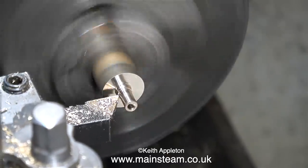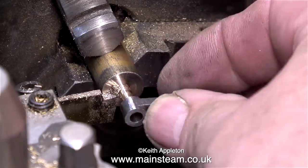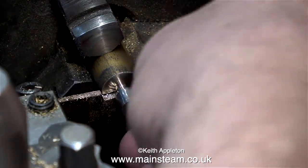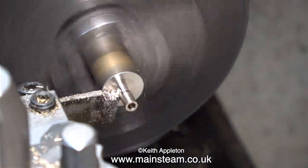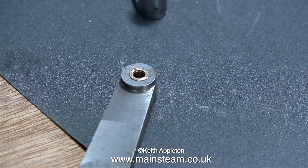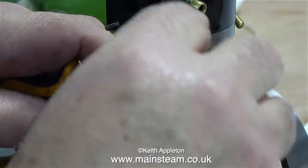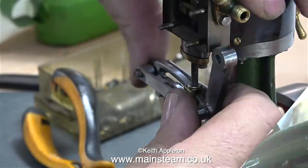To allow for parting off, I'm just taking off a bit more of the metal — it will make parting off slightly easier. What I'm doing here is trying the drop arm in position and then setting the parting tool to cut the bush to the correct length. A number 40 drill is definitely a clearance size for a 7BA bolt, but it's a tight clearance size — but that's what's shown on the Stuart models drawing, so I'm sure it will all wear together once it starts to run.